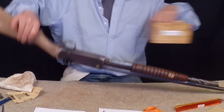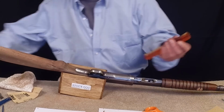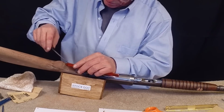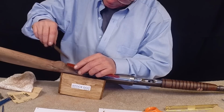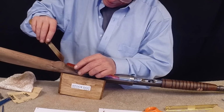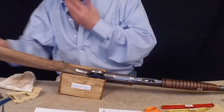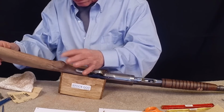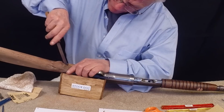So what we're going to do, we lay in our box. I'm going to grab our filler sticks and a knife. This one we'll just use the burgundy for. And we're going to lay that right on top of that. Now we're going to fill that from the top to the bottom, it'll flow in. So that'll dry in just a couple of seconds. Wet your finger. Just mold it onto it while it's still a little pliable. With your knife again, and now work in the direction of how it's shaped.